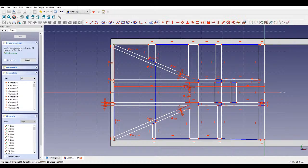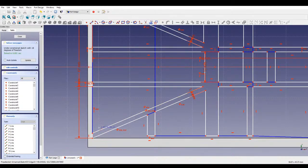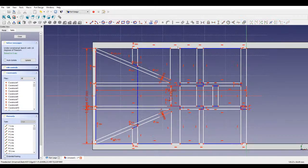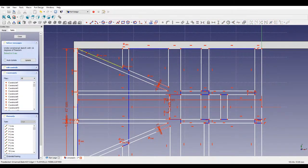Right. So because I'm being forgetful, this has, from the design get-go, self-contained buffers. So there is no need for it to have the recess behind the headstock, which is this plate here, as opposed to the sole bar, which is the one that runs sideways. It would have no need for these pieces because there's not a bar running out the back of the headstock because it's self-contained. So that means they can go all the way up to the corner, which in theory makes it stronger in terms of rigidity, if nothing else.